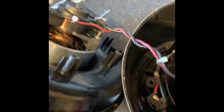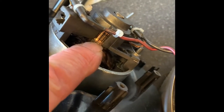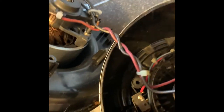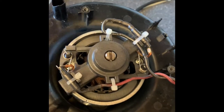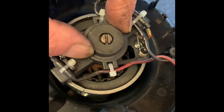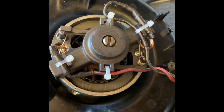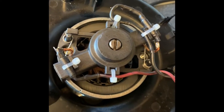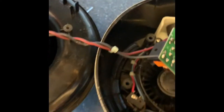The other problem I had was the commutator here. Carbon dust built up around the brush holder end of the motor inside, and arced across and burned the inside of this. So I had to get my Dremel and clean it up, blow all the carbon dust out, and take the motor apart and clean it.